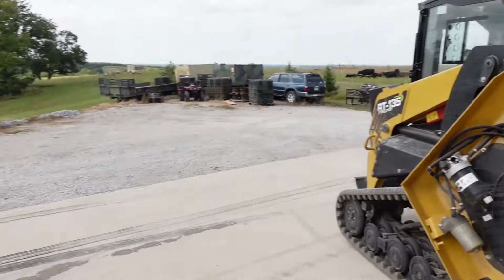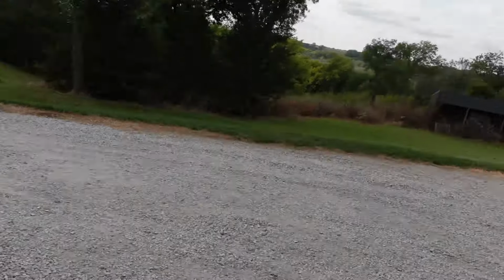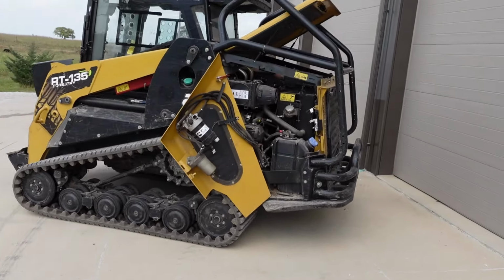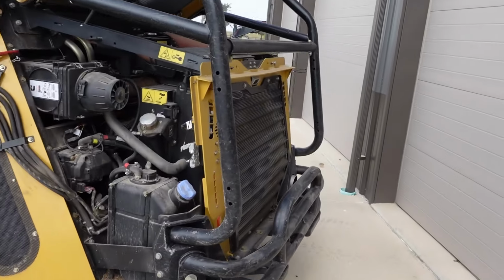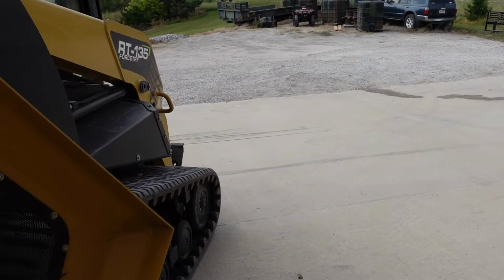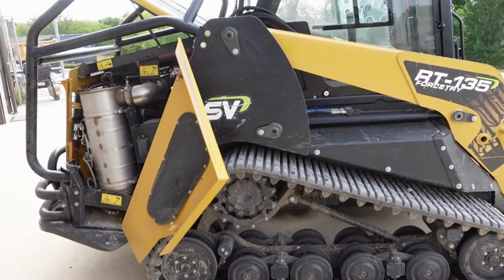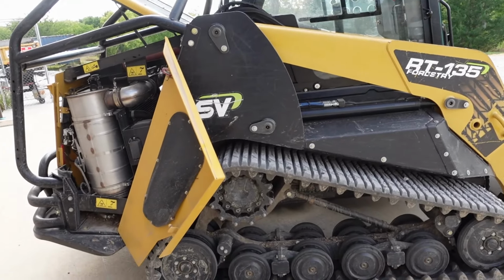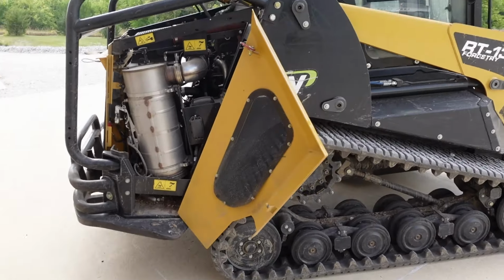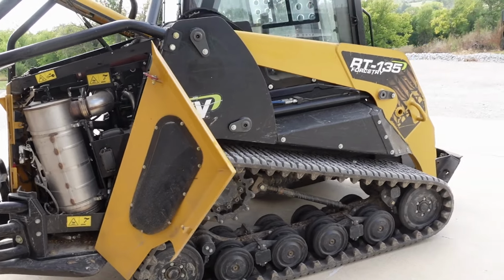And just to go off on a little tangent, another thing about this dealer, trying to sell this dump truck. It had a little leak. It has a double action cylinder on it, which is kind of stupid for a dump truck because the bed comes down with gravity. You don't need to power that cylinder to make the bed go down. But it had a weeping seal between the shaft and the head, which means that's on the retract side. So it's only leaking when the bed's coming down. The bed's going to come down with gravity, so you're never really going to see pressure on that side of the cylinder unless you let the bed all the way down, then hold the lever. So it was a little weeping seal.